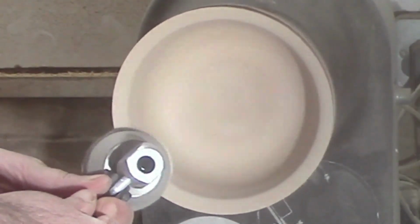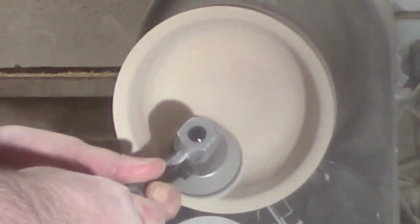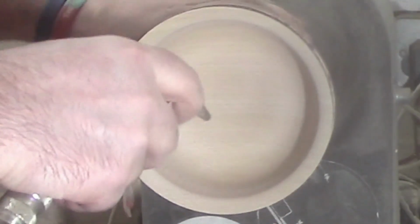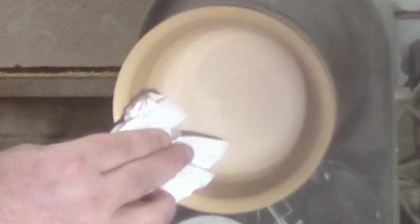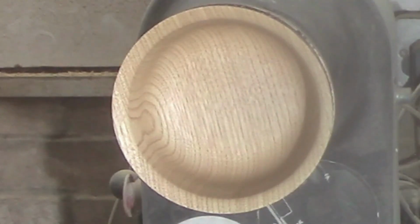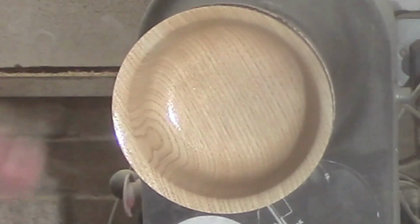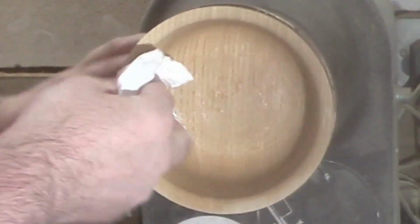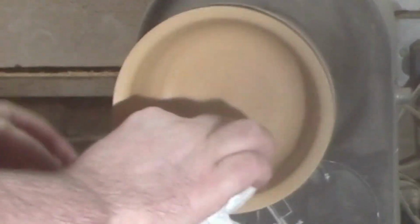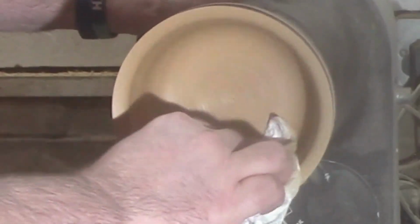Alright, once again, already done most of the sanding, so this is just 240 grit. Bit of compressed air, some methylated spirits or denatured alcohol to clean the grain, some sanding sealer, some Yorkshire Grit abrasive paste. Once again you just wipe it on until you get a clean paper towel and you have the equivalent of around about 1,000 grit.